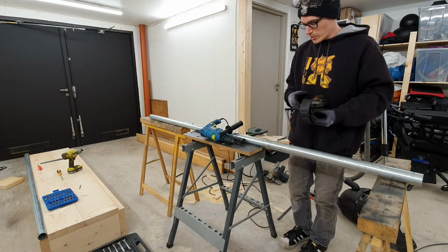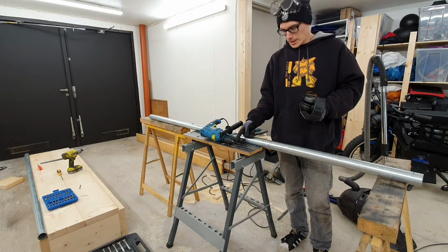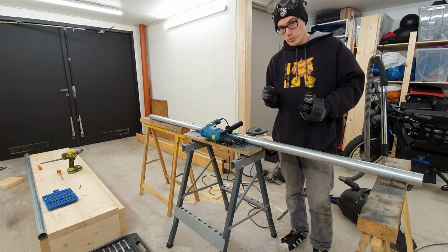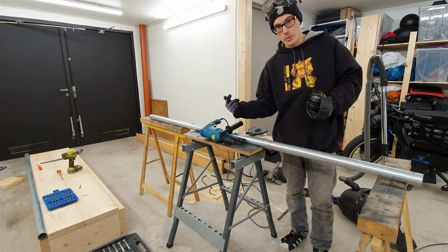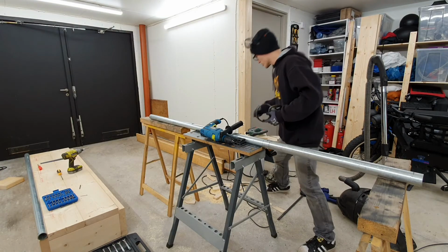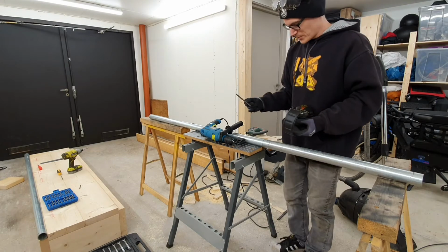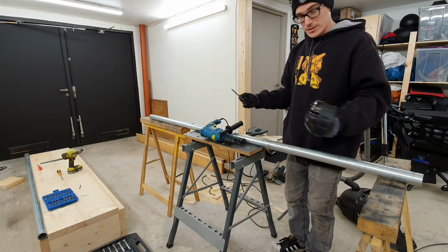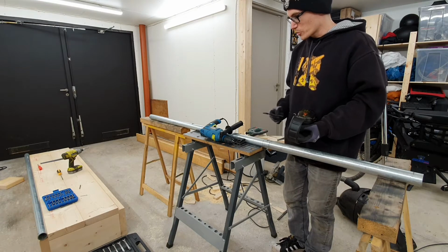And what I've been doing, I've been starting with this 4.5mm bit, and that's big enough for the screw to pass through. But then for the screw head, which obviously needs to pass through one side of the rail but not the other, I've been using a larger, I think that's an 8.5mm drill bit. So that's drilling through metal to put metal coping on a wooden box.